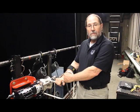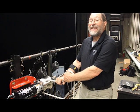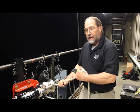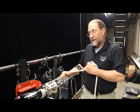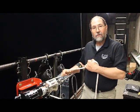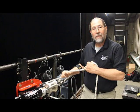If you're not able to see both with an easy turn of the head, then you need a spotter. Having a spotter is a good idea anyway, but if you can't see both — don't have a clear line of sight to both — then it's a necessity. So that's the basics. There are certainly many applications for this winch in the theater, but that's the most basic one.